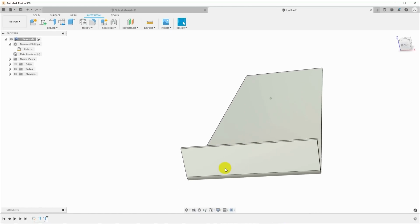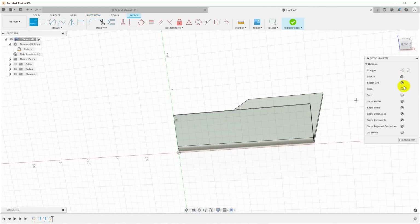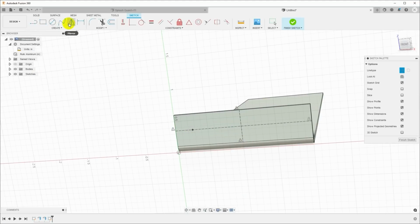And this is going to be the plate where we're going to screw it in. So I'm going to right click here and create a sketch. L for line, set that to construction, and we'll just pull a couple of construction lines across aligned with the midpoints. Create a point, and then mirror that point around this center line. Then hit D for dimension, and I will dimension those 2 points. I know these are 1.55 inches apart because I measured on the plasma table after I already made one 1.5 inches and it didn't fit.